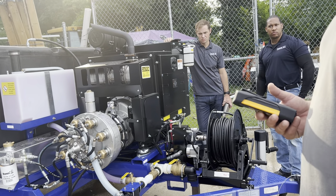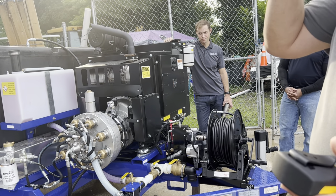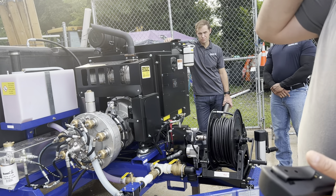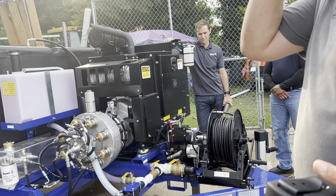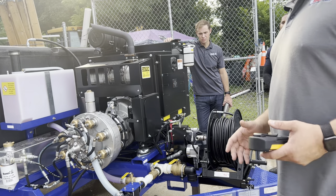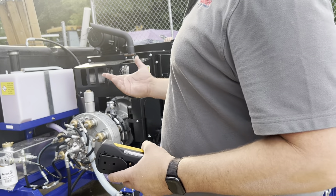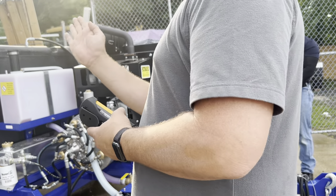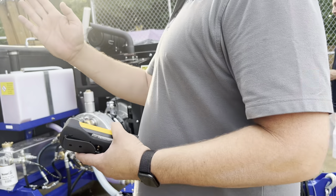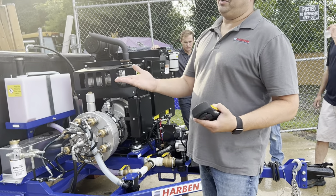Is that under warranty? It is, yes sir. Under emergency situations it's fine. You just don't want to be doing it constantly, because you're talking about 500 PSI versus 4,000 PSI turning the switch on. Over time it's just going to wear that switch out. The point is just to extend the life of this — it'll probably last thousands of hours, but our job is to make sure your equipment is running as long as possible.